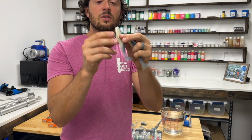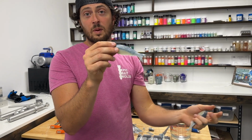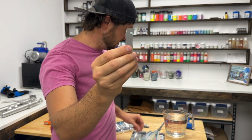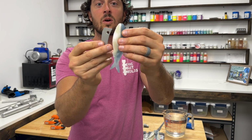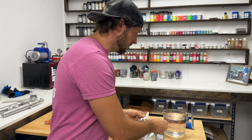And because we have the hook slot in the belly there, you can actually throw this on a swim bait hook with an underspin. And the reason you can do that is because this insert can be turned around. So if I show you here, the insert lines up with the belly, or if it's turned around, that's what creates that hook slot. Let me show you the mold.